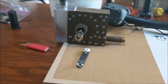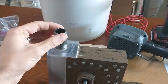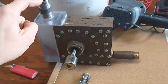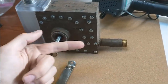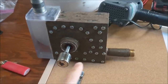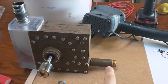When I first turn this turbine on, there's virtually no back pressure on the inlet, and the gas goes straight through the turbine. You see nearly as high a temperature on your exhaust as the inlet. But as the turbine gets going faster and the centrifugal head increases and opposes the flow, you will see a lower and lower temperature on your exhaust, which means you're extracting more and more heat energy. You'll also see a pressure drop on the exhaust as the turbine speeds up.